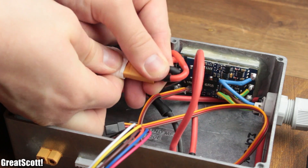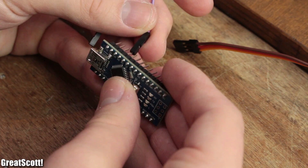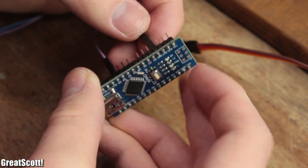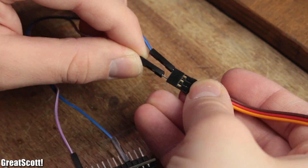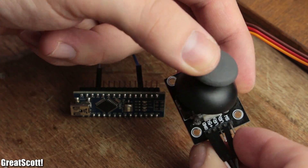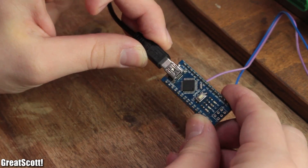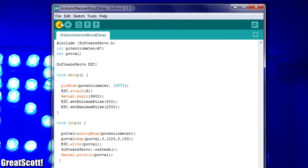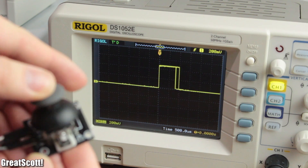We can grab the three-pin female header of the ESC and continue with the controls. For a first try, I connected the brown ground wire to the ground of an Arduino Nano and the yellow data wire to D9. To send out an easily changeable signal, I also hooked up a potentiometer of an analog stick to A7. The code I then uploaded creates a small voltage burst that changes the time of its high state proportional to the position of the potentiometer.